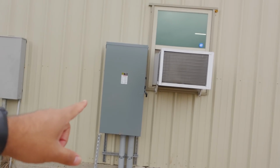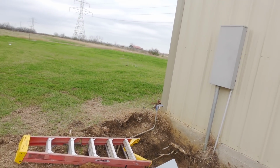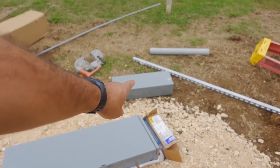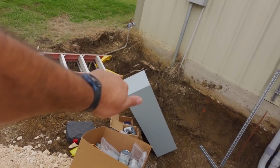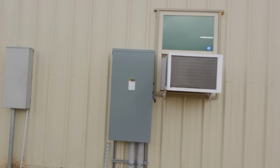However, the National Electrical Code says less than 6 throws of a hand, you do not need a main disconnect. Throws of a hand means exactly what it means. That's 1 throw of a hand, 1 throw of a hand, and 1 throw of a hand. 3. Code says 6 or less, you do not need that.